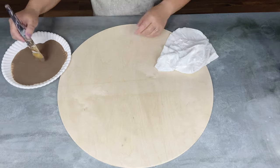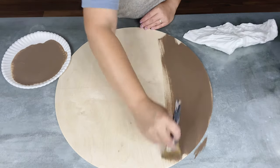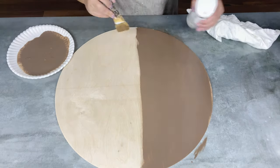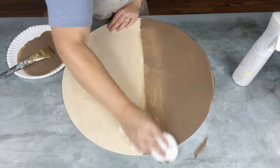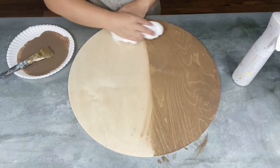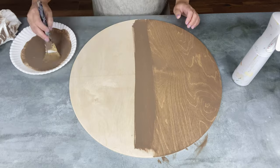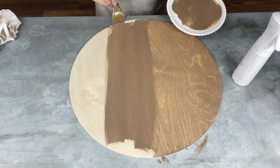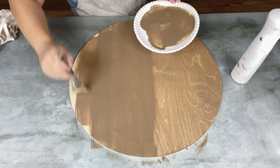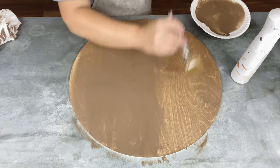I made a custom stain with chocolate chalk paint — a chocolate color chalk paint — and then I watered it down and just created my own stain. You've probably seen me do this before. I like it because I can easily work indoors with it; it's water-based, no toxins, no fumes. All I do is brush it on and then wipe it back with a clean rag.